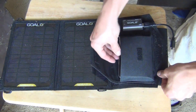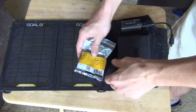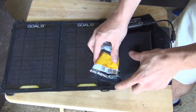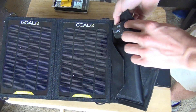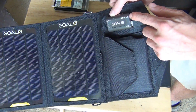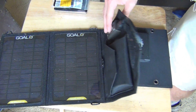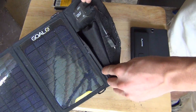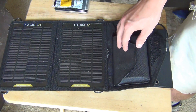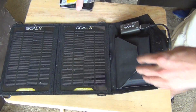It has two solar panels and a pocket where I've put a backup battery and some cords. This solar panel has no actual battery on it, it just is the panel itself. To use it, you have a USB, a Guide 10 plug which is a little circular plug, and a 12 volt where you can put a car adapter. The bad thing is the only thing it charges at full 7 watts is that tiny circular plug for their specific Goal Zero Guide 10 power pack, which uses nickel metal hydride batteries — an AA rechargeable pack. I'd much rather use my own backup battery.